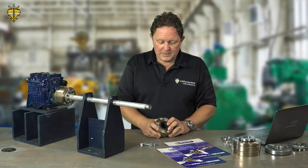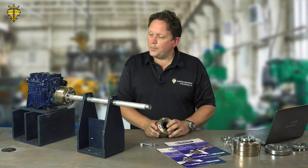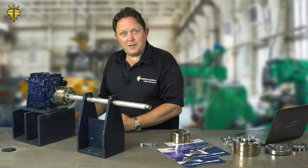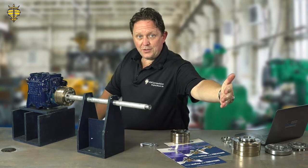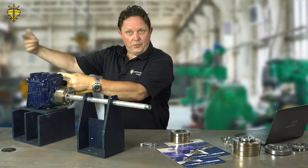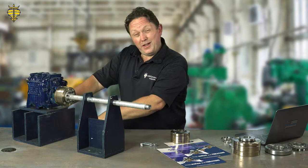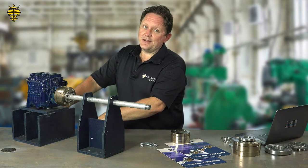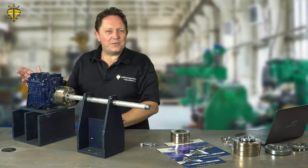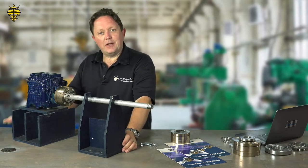The problem — or rather the limit — with constant velocity couplers is that they can't take a thrust load. When you come to a marine environment, the engine mounts, the propeller makes thrust, thrust goes up the prop shaft, comes in through the coupler to the transmission from the engine. Those four rusty things under the bottom of the engine are what actually drives the boat, and most people don't realise that. They're really, really important. If you just replace one, or don't manage them or look after them, it can have a serious impact on your alignment.